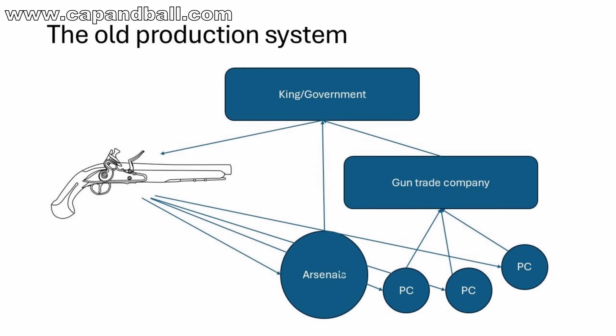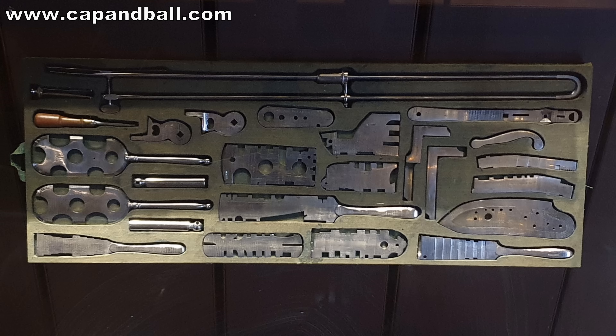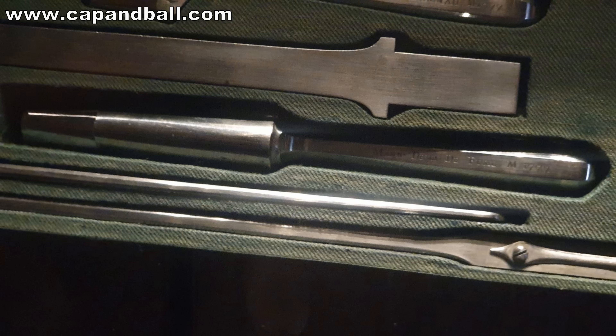The old system was simple: the army was in contract with trading companies who received orders and pattern arms approved by the king. These pattern arms were distributed to manufacturers, who delivered complete arms — copies of the pattern arms — to the trading company. The new system was different: the trading companies' position was weakened and the army supported contracting manufacturers directly, while arsenals were elevated in the system. The government provided gauges, dies, and templates to manufacturers instead of sample arms, while inspectors were sent to important production facilities. Templates were used as guides for hand workers, made of hardened steel so files wouldn't damage them. Gauges were used for verification of part sizes. Private contractors delivered parts to state arsenals where they were inspected before assembly. Only perfect parts were used; rejected ones were returned to contractors.